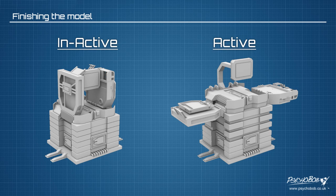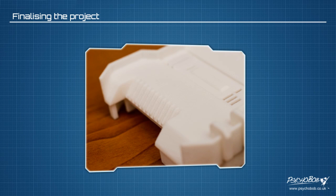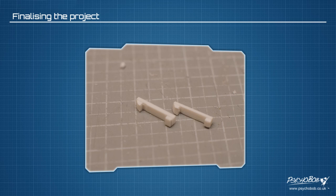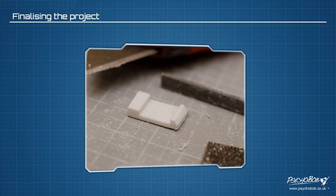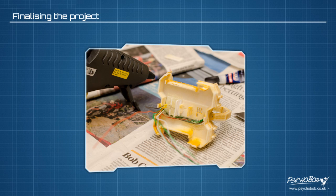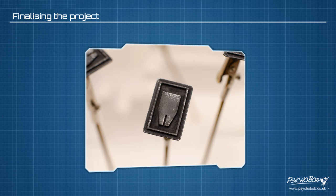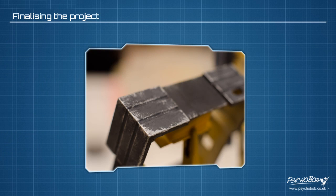The electronics were completed, so I placed the order and the parts from Shapeways arrived after a week or two. As with any 3D printed parts, the first thing to do is clean the parts and remove any excess powder. Then comes the worst part of the project — sanding. Lots and lots of sanding. Once this was done I then used some styrene to add in some extra parts and then I began painting. I weathered the piece with some silver paint which on hindsight may be a little bit over the top, but I still quite like the end result. Finally I assembled the piece, fitted all the electronics and had the finished product.